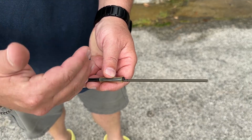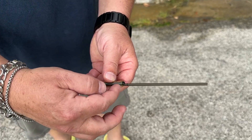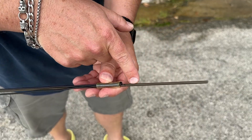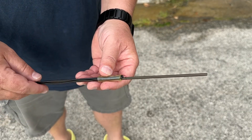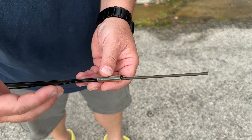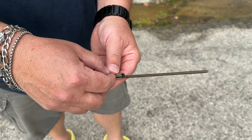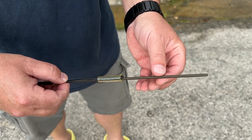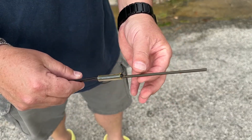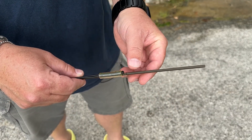Making my loop around that Sharpie mark, I'll be in tune on 40 and 15 every single time — it's worked for me for years. If you do need to lengthen or shorten it, you can bring this loop up or down. If 15 is showing a little long, you can shorten this; if it's showing a little short, you can lengthen it. You can tune both 40 and 15 just by moving this foldback up or down towards the tip.